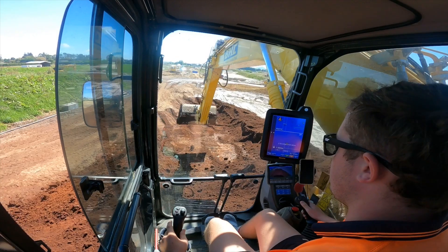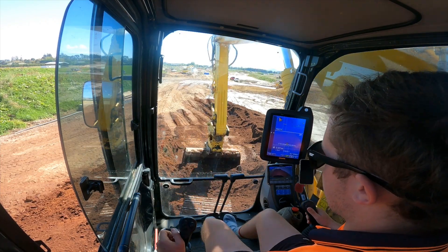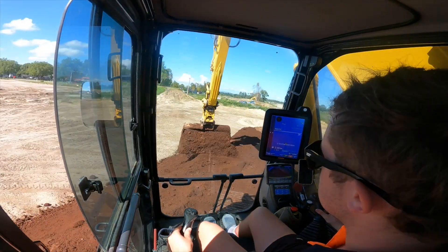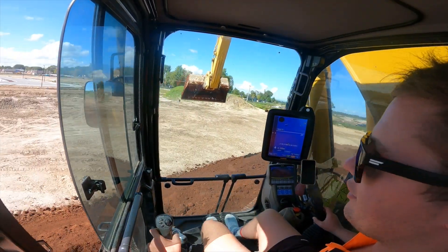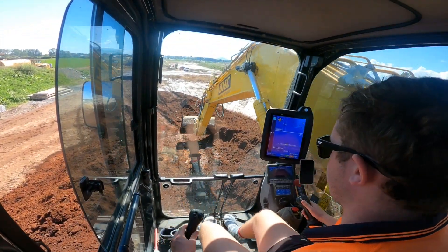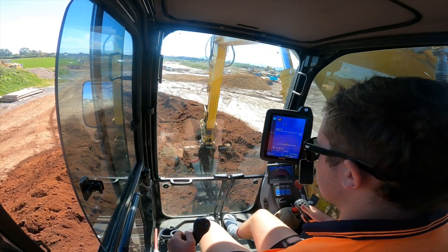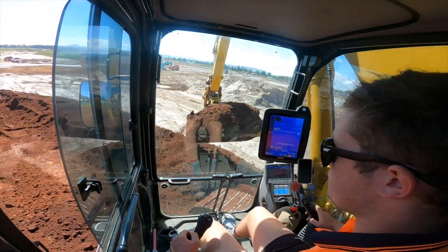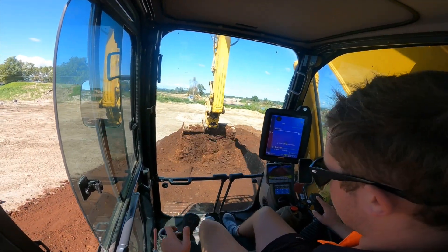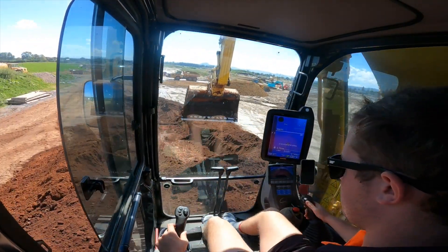The boys are coming up from that end now, spinning around down where that yellow digger is and then backing up. I'll make a bit of a ramp and ramp it up, just like how any other stockpile would be done with a dozer. Make the ramp so they can just keep dumping — so they're not relying on me constantly moving the dirt. Then I can focus on moving the pile and shaping it up how it should be. That's usually how I run them when I have a dozer — give them room to tip it off and let them go at it.